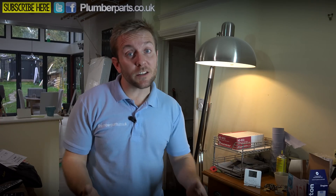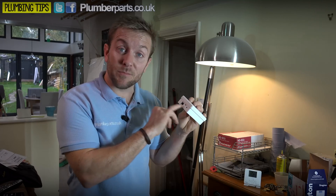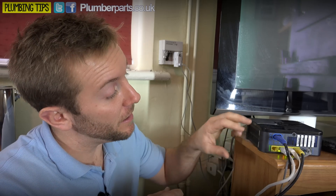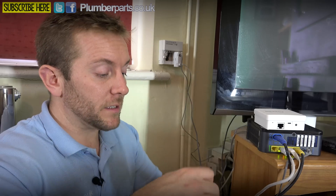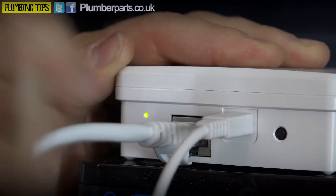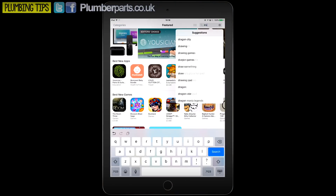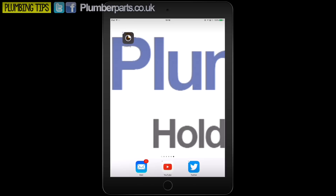Now all you need to do is find out where your customer's wireless router or internet router is. We've got a nice MyGenie gateway here — on the back you've got a plug for the Ethernet and a small plug for the power. All we need to do now is set up our MyGenie gateway. We've got our internet router down here with an Ethernet port and we've got our little MyGenie that I'm just going to pop on here like so. All I need to do is get our plug, plug that in and pop that into the back of the MyGenie — we've got a small light there. Then all we need to do is get our Ethernet cable that's supplied, plug this in here, and you'll see that these two start communicating. Now I'm just going to pop over to the App Store — I usually just type in Drayton on the customer's phone or on their iPad and then we see we've got the MyGenie app. Just get that and install that. We've just got the download timer coming up — if you've got a nice quick internet connection, it shouldn't take too much time at all.